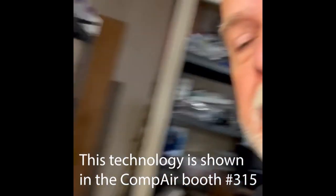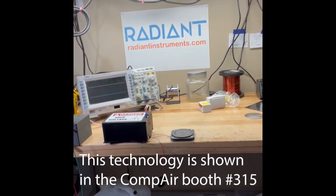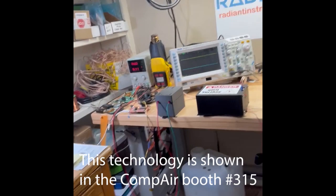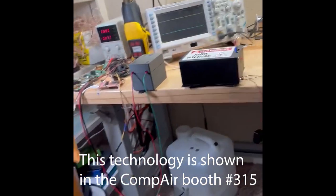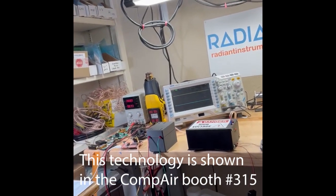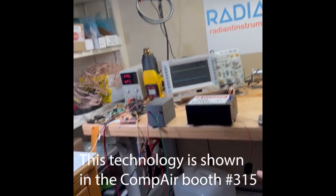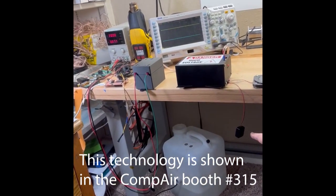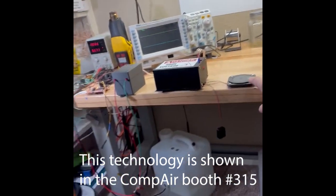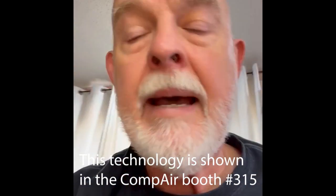I do have some of the hardware that goes into the system in front of me. Essentially there's a 28-volt bus coming from a power supply — it should be coming from your source on your aircraft — and then a high-voltage step-up module that I've designed, along with a high-voltage energy storage module. I'm firing it at will using a plain old switch. And then there's an actuator coil that I've designed as well, which is where all the fun happens.